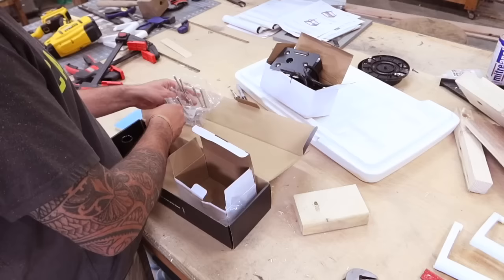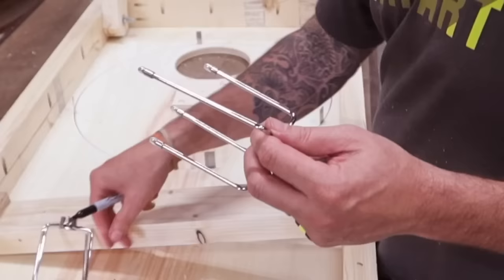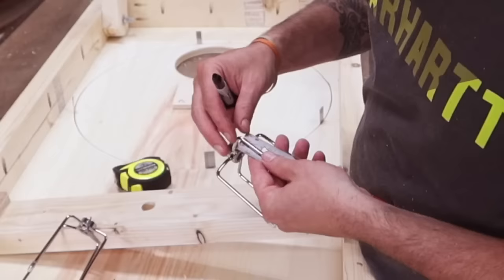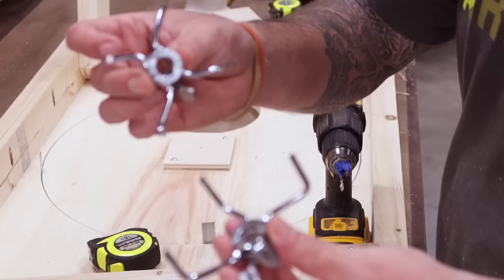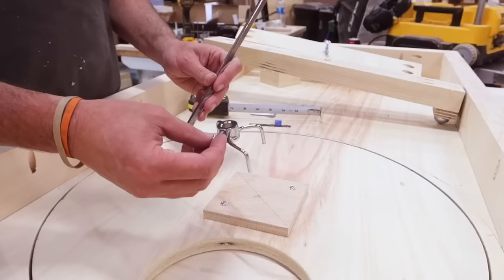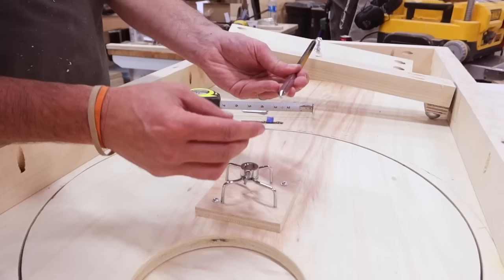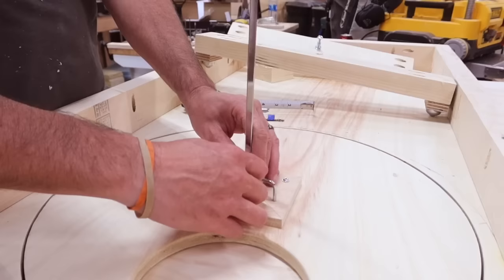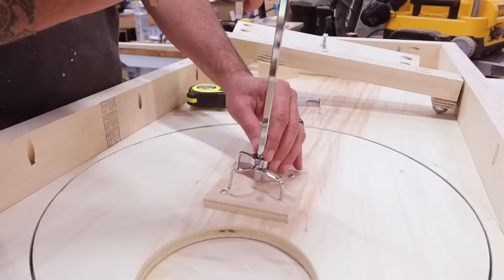We'll be using the forks and the quarter-inch square stock from the kit. Since the forks already have an adjustable collar built in, they're perfect for this project and for making fine-tune height adjustments. The prongs are way too long, so we're going to cut them down to three-quarters of an inch in height. You can use bolt cutters or an angle grinder — there are several ways. Now, a trick I learned on the second board: once you put your rod in and screw in the set screw, it shifts the rod out of center. One of the rods that comes with the kit has a point — place that point where the center screw was and then tighten the set screw. This will keep the forks centered to the rod.